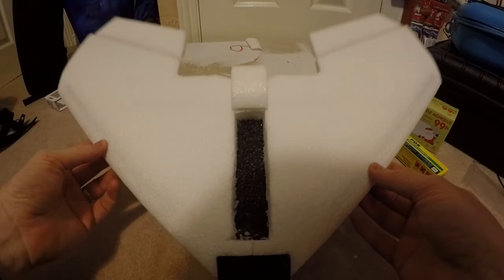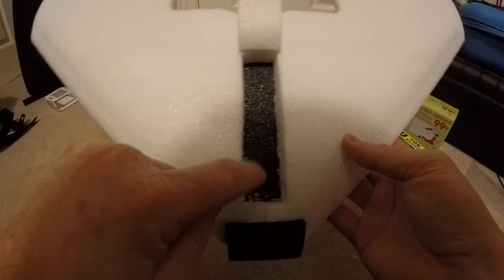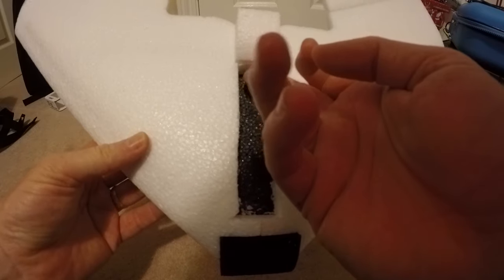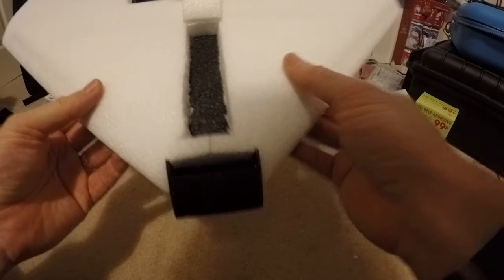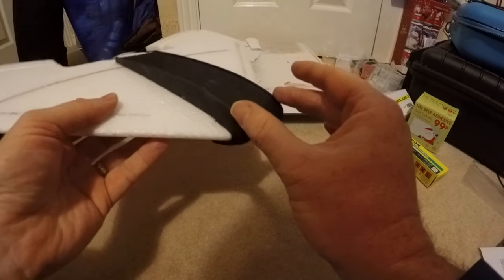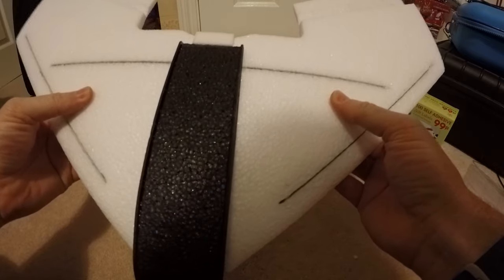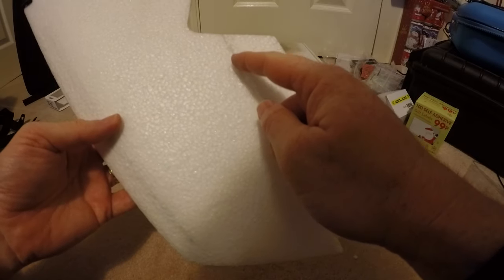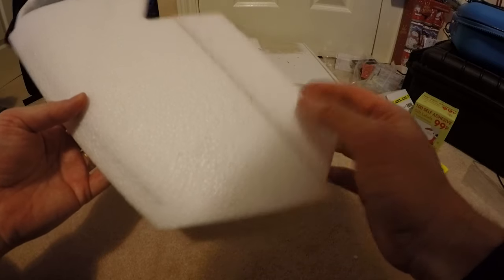So here's the wing having done a bit of the cutting and gluing. You'll see I haven't got a very straight line here — it's all a bit skew-wiffy. I'm still a little bit stuck on the length for that. This actually turned out a bit too far so I've got a little bit of foam stuck back in to give that some strength. But we've got the skirt on which seems to add some strength there. It's got the wood down the side, put the three spars in and it's pretty stiff — no problems there. The elevons I actually just put on with a bit of UHU Por over here, and they are really good — really flexible and they hold on really well.